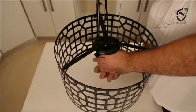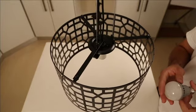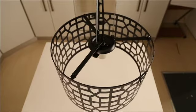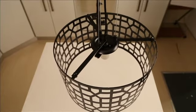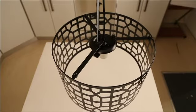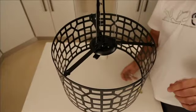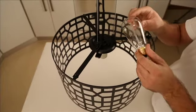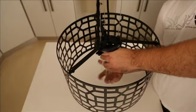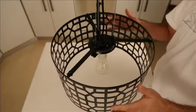I'm going to change the light now. I was using a 7-watt LED cool white light — I think it's about 3000 Kelvin. That's recommended only because you don't want to be changing it too often, but it's not a big deal if you do want to change it. I'm going to show you what it looks like with Edison light bulbs. These are great — they're very popular and in now with all the cafes. The Edison bulbs are 25-watt, so they don't get too hot and don't give out a lot of light, which makes them really nice and ambient.